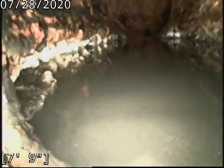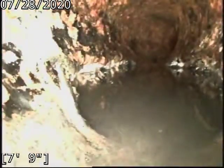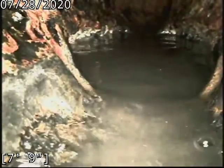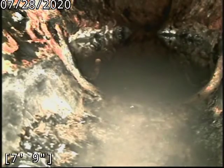So what are we talking here, guys? A plumber. We're talking, that's not our wheelhouse. Gotcha. I mean, we could possibly do a CIPP repair, but that's just not really cost effective. A CIPP is kind of like a heart stent to repair that section without taking up the floor. For this one, you'd be around 2,200 to 2,500 bucks. They're outrageous, but they have their point.